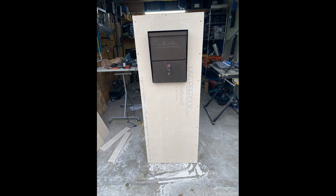Unfortunately the GoPro camera battery died while I was doing the cutouts, but I just took a vibrating saw — a multi-tool with a rounded blade — and was able to trim off the top and cut out the hole for the actual mailbox to sit into the front frame. Something important to keep in mind: I left an extra eighth of an inch in both directions — vertical and horizontal — in that mailbox hole to allow a little bit of play, but mostly to accommodate some J-metal which will frame out the mailbox and act as the transition between the actual mailbox and the hardy backer board.